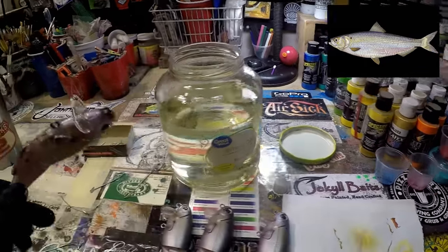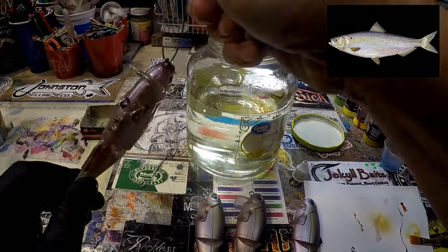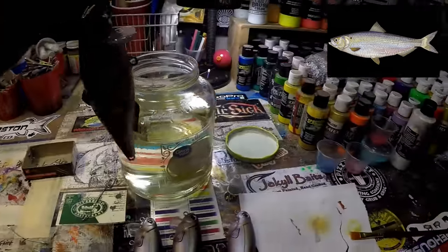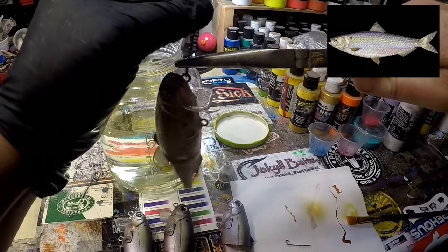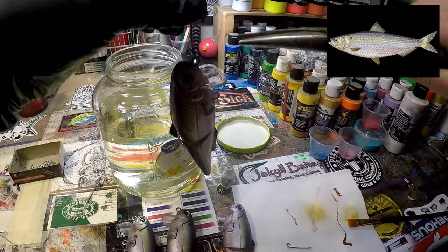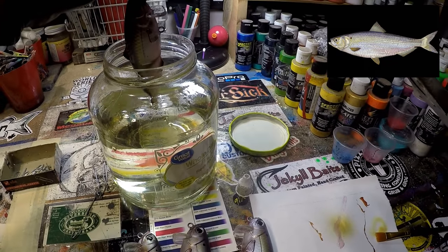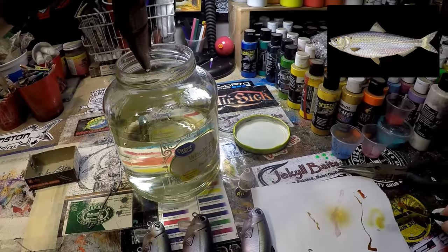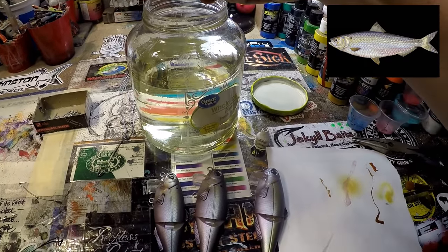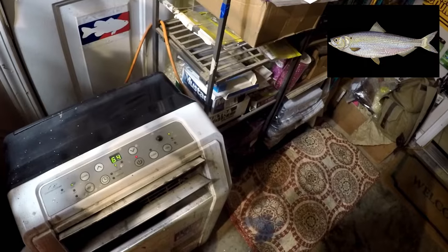Set this here, get a drip wire — I'm not going to show you all four, no need, just this one. I always wear gloves when I'm clear coating, at least one glove. And now we just dip that bottom in — be very careful not to go above that little line right there, just kind of smooth it out. Put the drip wire on and bring it over, and there you have it. You're good to go — just let it hang.